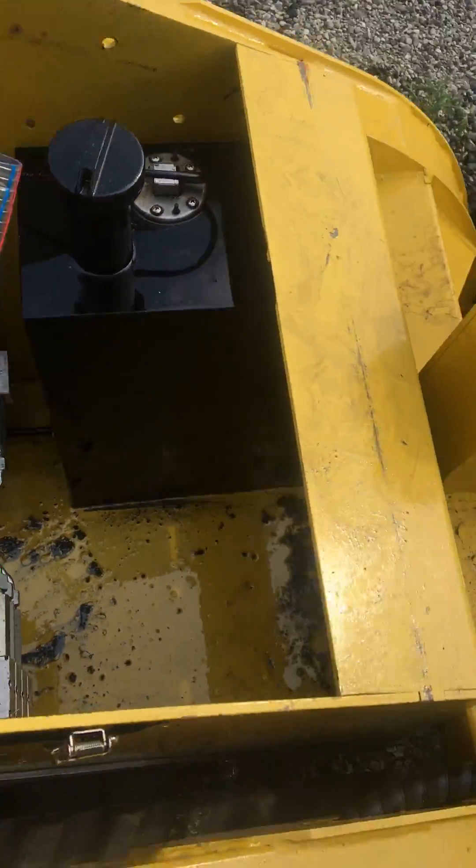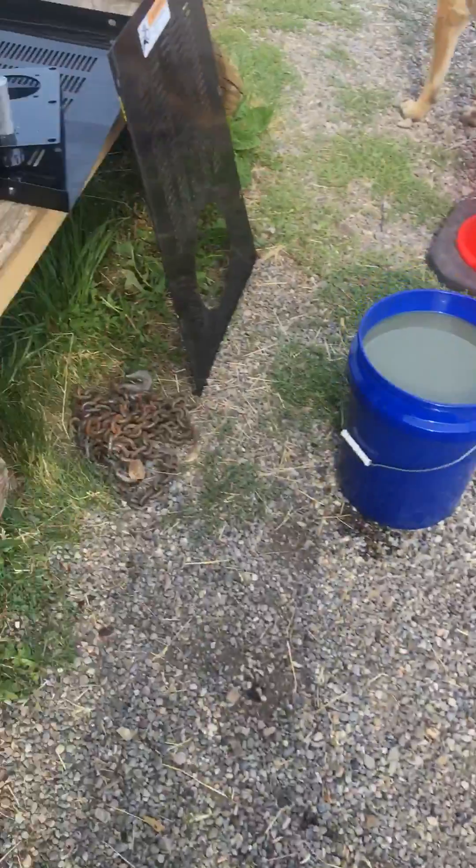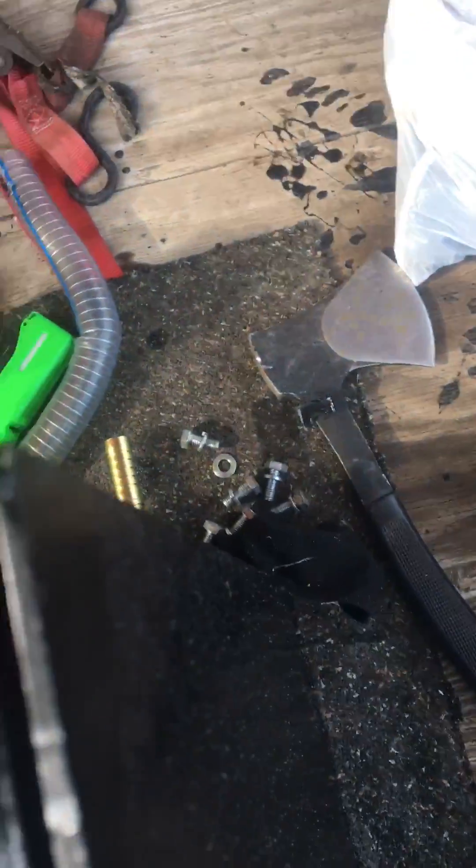The hydraulic reservoir sits right in here. What I found out was happening is in the hydraulic reservoir there's a cap on it — it goes kind of like this. But between the cap and the actual reservoir there was a gasket. There's a little gap right between this cap and where the gasket is right in here, and water just runs right down into the reservoir there.